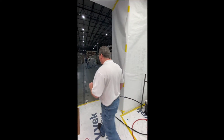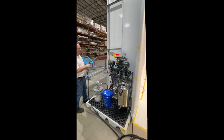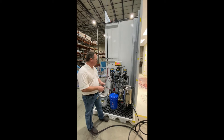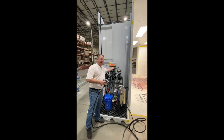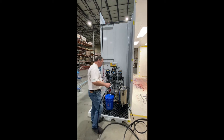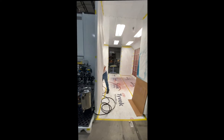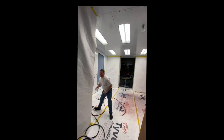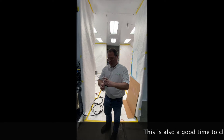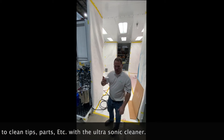Come back out to the controller. You'll see it's back into standby mode — no green light, so it's just sitting here idle. It knows it's been flushed. I would then just turn off the system if it's the end of the day and let it power down. I've got my gun and hose, and I would put my air cap and tip in a little container to soak overnight so that nothing could get hardened there.